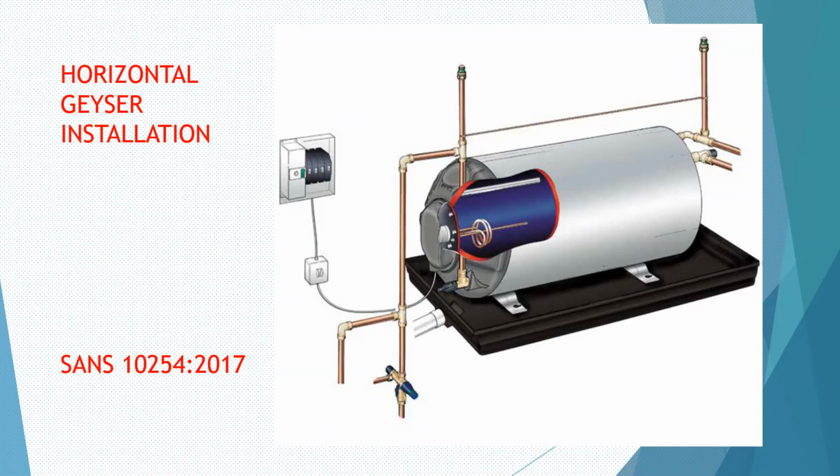and 900 coming in. So that cold water pressure has pushed right through that mixer, through the cartridge, and overpowered the hot water side through the mixer to the geyser, and actually pushed up against the hot water line into the geyser, right through the geyser, overpowering the incoming pressure of 340, and manifest as a flow through your expansion relief valve. So guys, that process that is happening there is referred to, as you know, as back pressure.